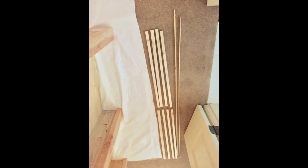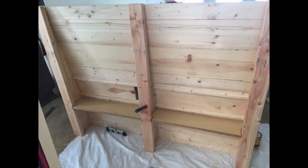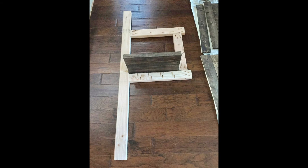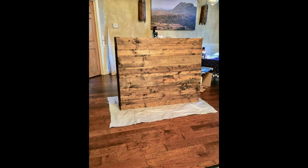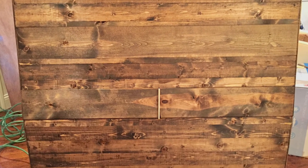I cut strips of 1x4 to hold a shelf and to support the sliding door, and built two side pieces with 2x12x15 inch shelf tables to join up to the center section. I also added some thin trim cut from 1x4s, and cut the trim with a hacksaw where the sliding cupboard door would open.